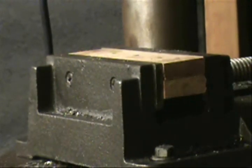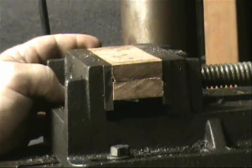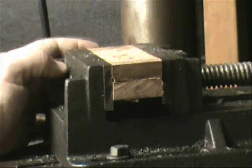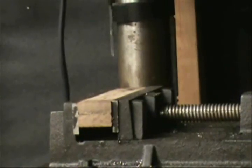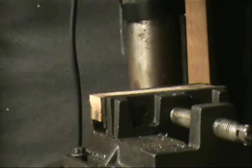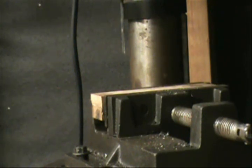What I've done is put those two sides of the handle in a vise. Now I'm going to drill through both handles at the same time — this way everything will be a matched set. You have to be extremely careful here because if you're off by just a millimeter, your pin will not go through, and you'll have to waller out the hole and it just won't be as tight as you want it. Remember, you have to use the same drill bit size that matches your pin size — it has to be an exact match. If you do not have a drill press, I would recommend clamping the blade to the handle and drilling it freehand that way, because you need the precision of a drill press to do it the way I'm doing it.